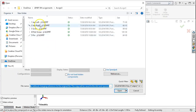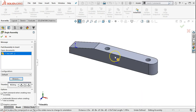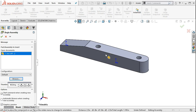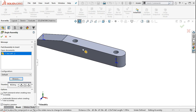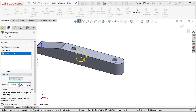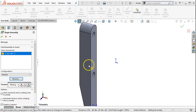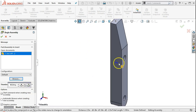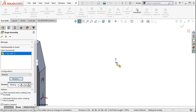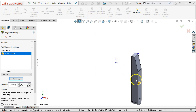I'm going to browse and just bring in jaw one and open. I don't have to make it look like the drawing we're working off of. To rotate, we're rotating about Z, rotating about X — if I want to rotate this up, we're going to click about Z. Another 90 degrees, another 90 degrees. If I try to place it on the origin it kind of jumps out. When I hit the check mark it should put origin to origin, but it's not going to do that because I rotated it. I'm just going to click in the work area and place the jaw.